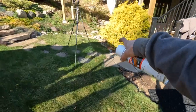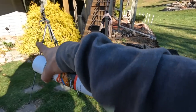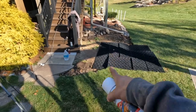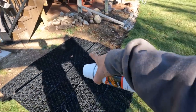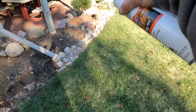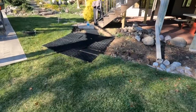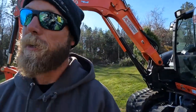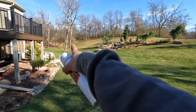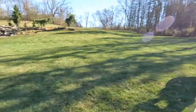As well as this downspout all the way over there. I may end up discharging that in the stream, or I'll bring it in and trench a line for the drain tile and bring it in high into the back side of the reservoir. The pump vault will probably sit somewhere back over there, and the overflow for this system will tie back into this dry creek bed that runs the perimeter of this planting bed and goes out to the swale at the far end of the property. We'll get the reservoir marked and start digging, get the truck cleaned out, put all the spoils we don't need in the truck, and drive them over and dump everything. It should be a pretty smooth project. We'll get a lot of this scratched out today and get ready for boulders tomorrow — it's just Jack and I, but we're going to make some serious progress.